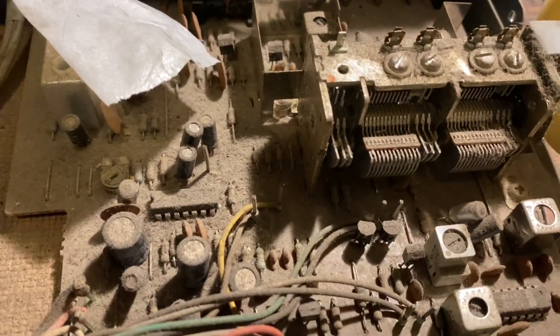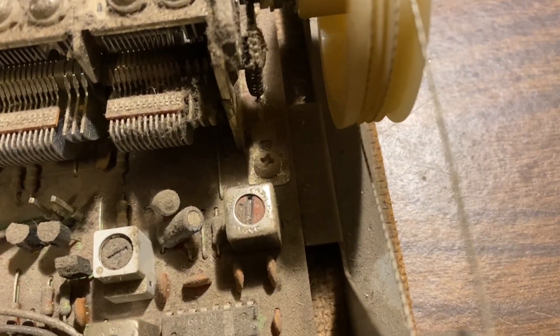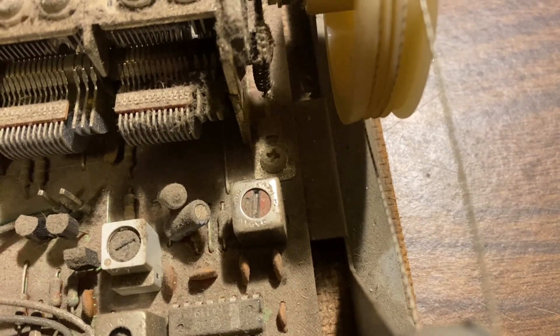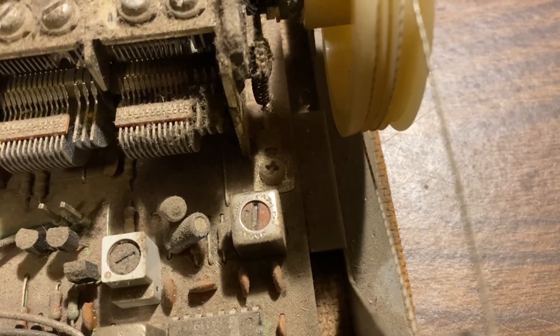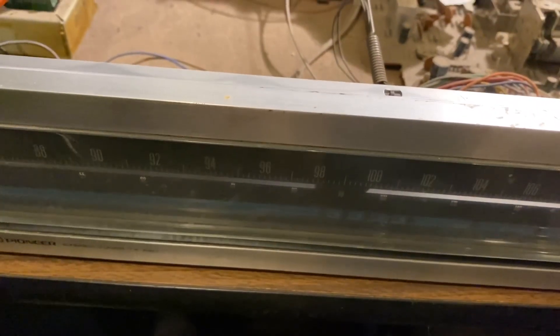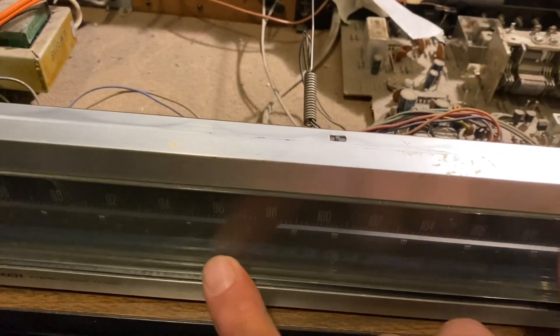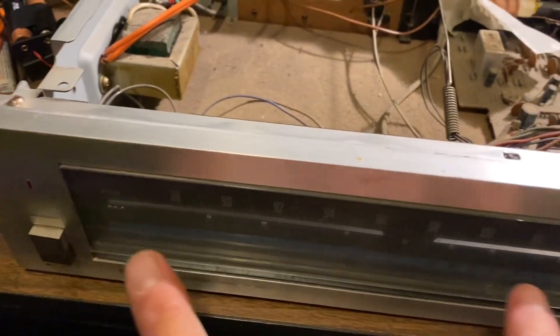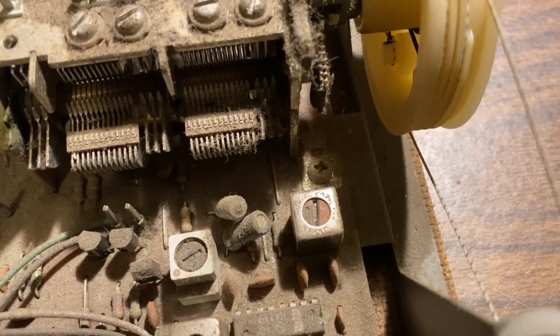One thing I did to enhance its ability is that can right there with the red screw on it — that's very important. I found another radio and tuned it very high to a station on the high end of the AM band. Then I adjusted that screw on that can until I brought whatever that was as far down on this dial as I could. In other words, I wanted to push all the AM stuff as far down as possible, so we'd be just above it and able to pick up a whole bunch of shortwave. That's something you'll have to experiment with, but it's not too hard at all.